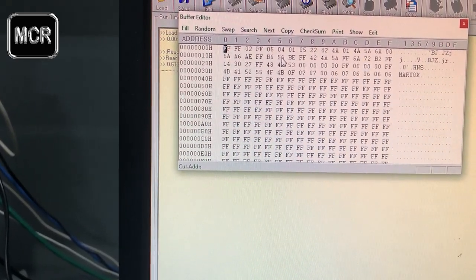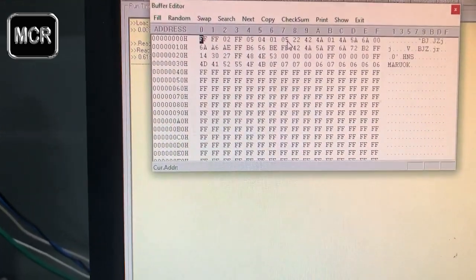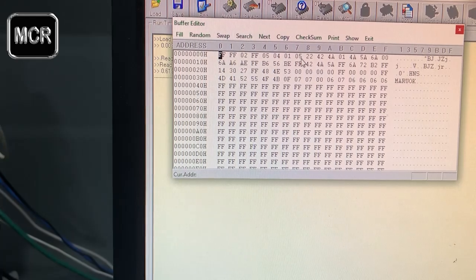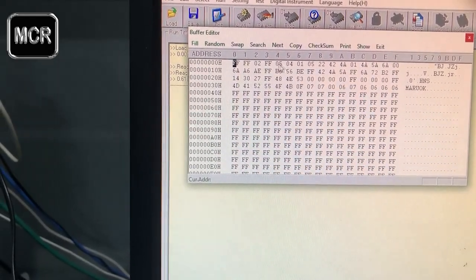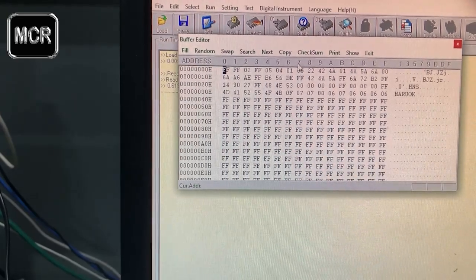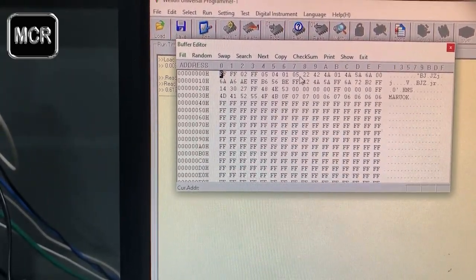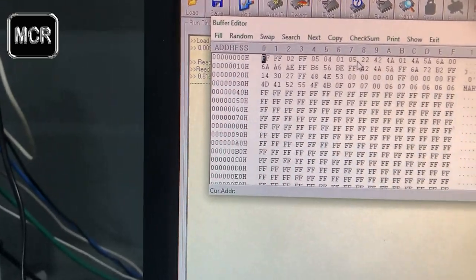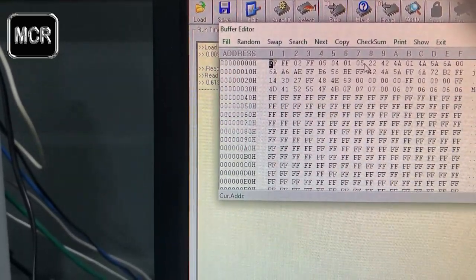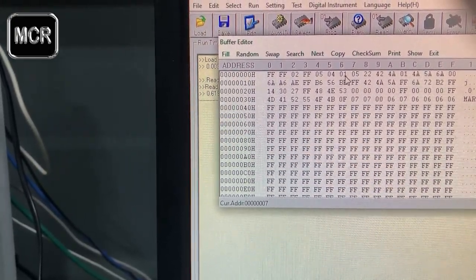Now, the secret is this. The secret is the pin number. The way they program is quite tricky. The person programming it will program the pin number going backwards instead. So you start with this location 7 here. That's the pin location there, and the first code number from this unit is this one here. It's 5. You can see there, that's 5. Okay, 5. Then you read to the left.